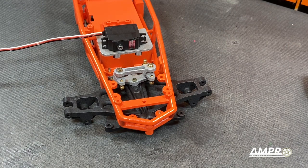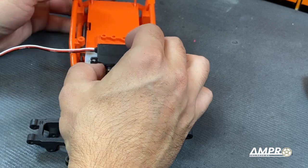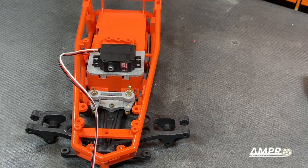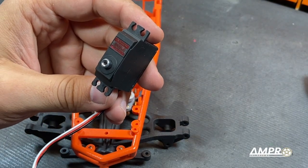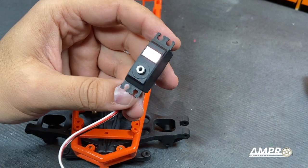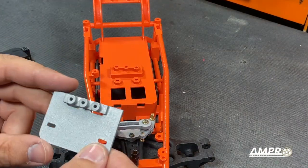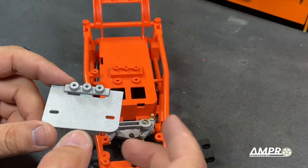I simply have no intention of using a standard servo for such an application. There's a lot of issues with depth and width, and it just wasn't worth it. So this is called the K-Power DM0260 digital servo. I'll have basic dimensions of this. For the production model of this part, it will come with the standoffs attached to it. In Shapeways, they'll be separate parts.